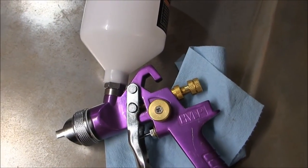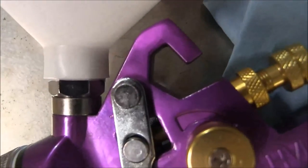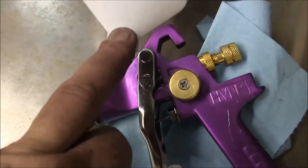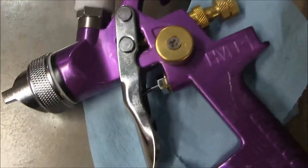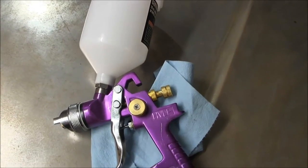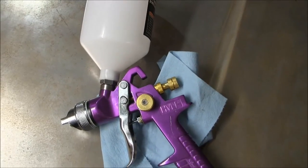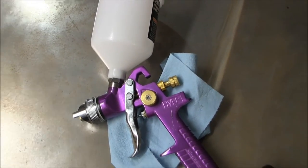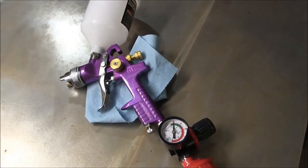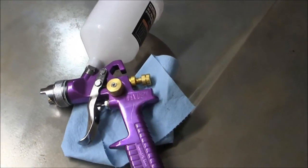Like I said, I've got them doubled up on there. I've already sprayed some lacquer thinner through my gun and the lacquer thinner did not leak out, nor was the flow hampered — because the filter in there keeps the O-rings centered. I just wanted to let you guys know that I did see online where this particular gun was having issues with leaking at the tank. So that was one solution I came up with. This is the Harbor Freight Central Pneumatic gun — part number 69705.